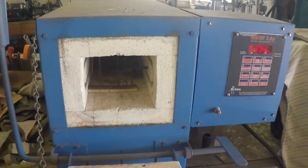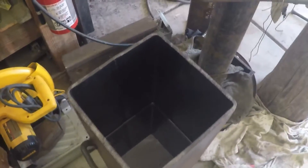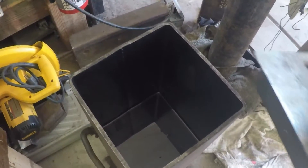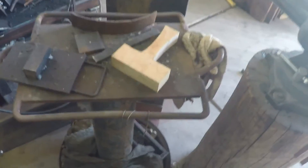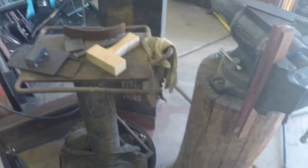I'm going to be doing three knives at the same time. This is my heat-treating oil quench tank — I've got Texaco 70 heat-treating oil in there. This is a drying rack for when they come out. With wires, when they're heated and quenched, they'll go there.